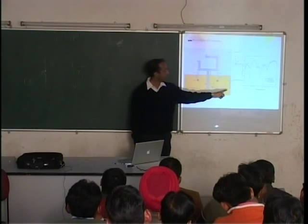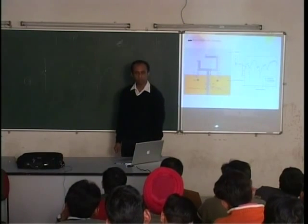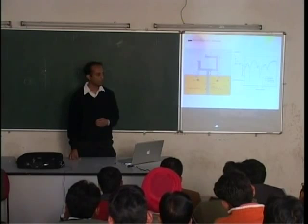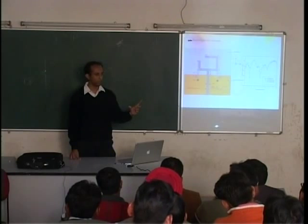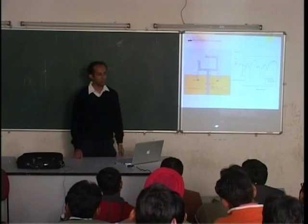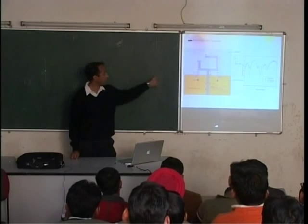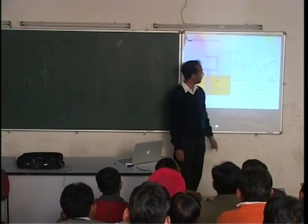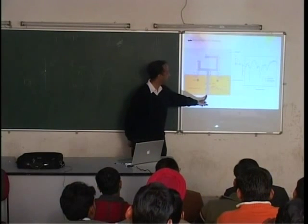This antenna, you apply a signal from here. And there are two diodes. When these diodes are biased on, when current flows through the diode, it's as if it's a short circuit. If it is biased off, it's like an open circuit from a small signal point of view. What is the small signal? It's the main RF signal. So when the diodes are biased on or off, the whole antenna behaves differently. How does it behave? It's a little difficult to see. As you can see, this figure has three curves. This is the S11 of the antenna, the reflection.